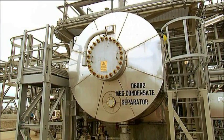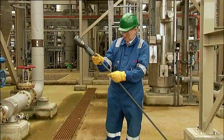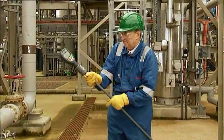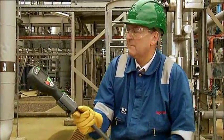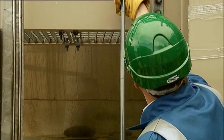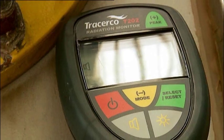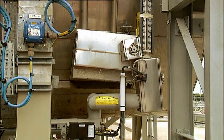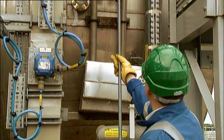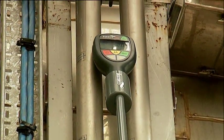Nucleonic instrumentation is installed in many oil and gas plants to provide a reliable means of monitoring and controlling process fluids. The T202 radiation dose rate monitor is extremely versatile and can be quickly attached to one or more extension rods to allow routine monitoring of difficult-to-access nucleonic instrumentation. The peak function allows the operator to determine the highest radiation reading recorded during the monitoring procedure. This approach is particularly useful to verify dose rates within vessels where direct operator access would be undesirable. The ergonomic design, high visibility readings, and robust nature of the T202 provide a comfortable and reliable handheld instrument for monitoring process pipework.